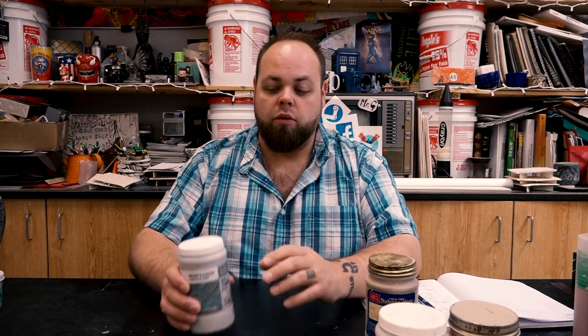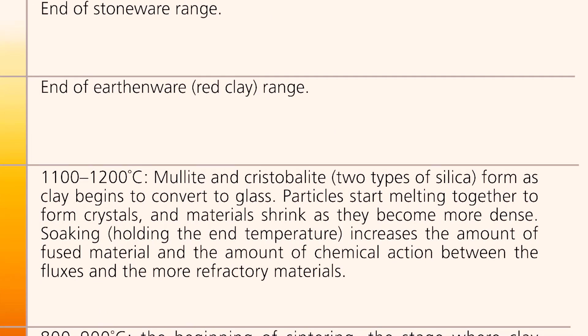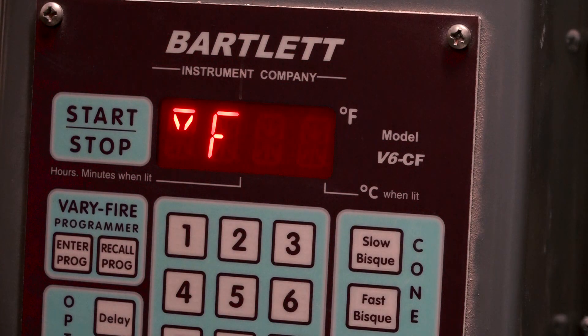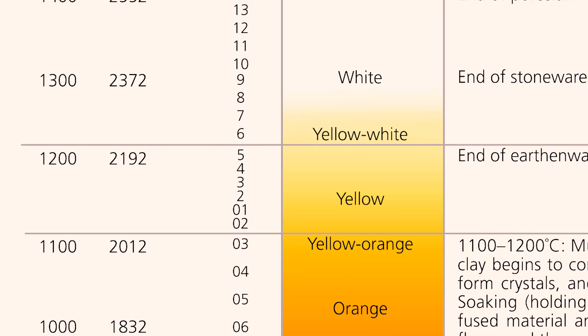These glazes need to stay in the firing ranges they're listed at. When you get a batch of glaze or go through a catalog, the directions will tell you — for example, 'glaze fire to cone 05 at medium speed.' Medium speed refers to how the temperature ramps up inside the kiln. Cone 05 is the recommended firing temperature for this glaze. High fire glazes fire to cone 4 and 6. Cone 4 is 2,124°F and cone 6 is 2,232°F — a 300-degree difference from the 1,945°F low fire range.